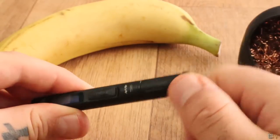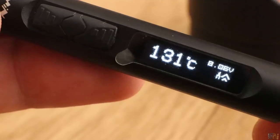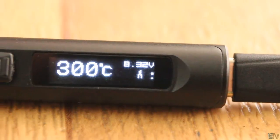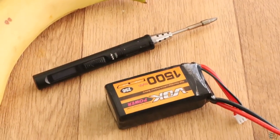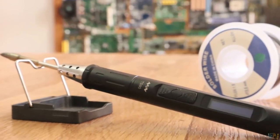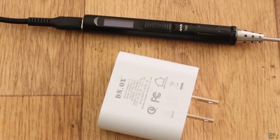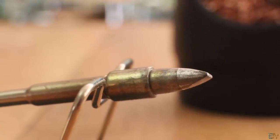So the final conclusion: great product and for sure an improvement from the last version. It is a little bit smaller and in my opinion has a better case and better firmware. It gets hot very fast and even for an 18W iron it has a lot of power due to the high quality of the tip, which is also easy to replace in case you damage it or want a different shape. It is low power so you could use it with an external power bank or battery, making it portable. When you buy it, there are some kits that already include a power bank, a carry leather case, or the iron stand — I'll leave some links below. I like the distance to the tip, the animated display icons, it can reach up to 400 degrees and that's the real value. It comes with a power adapter and the USB cable is heat resistant. The heating element is integrated in the tip and the heat performance for 18W is better than expected.